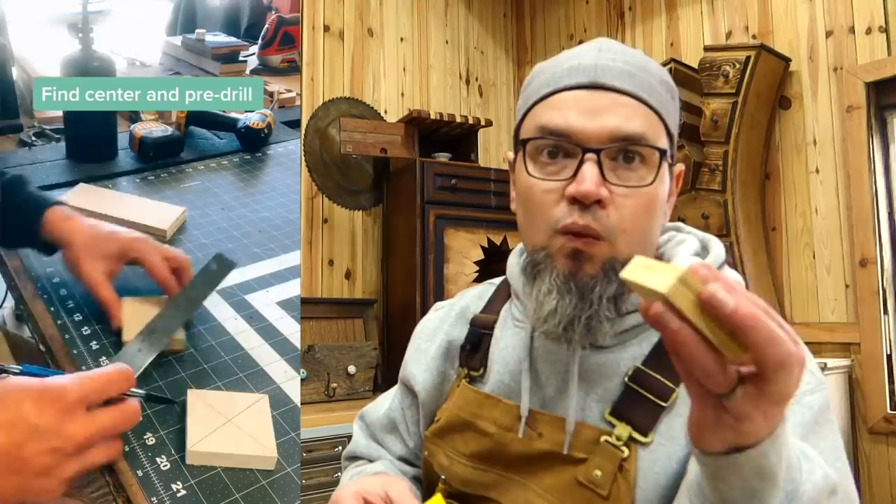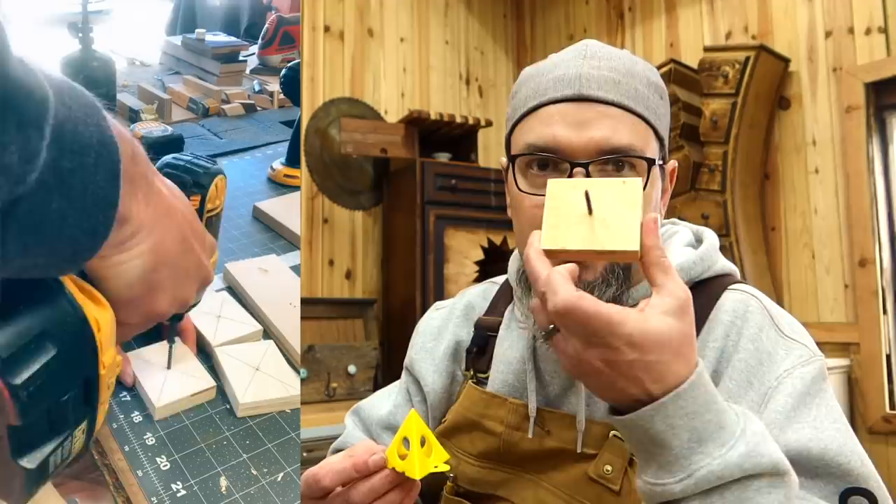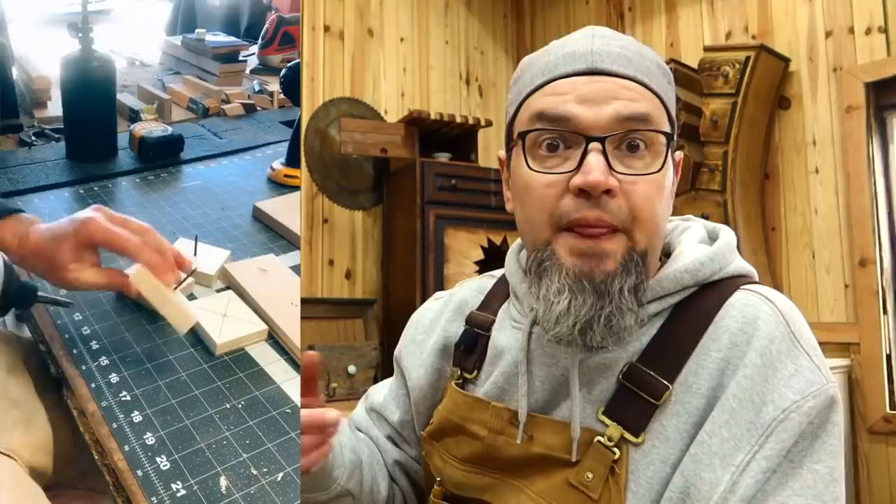I'm basically just taking some scrap wood and making standoffs for painting, staining, or whatever you'd like to do. They do sell these little cheap standoffs, but the ones we're making in this video are heavy duty — they have a lot more balance, they don't tip over nearly as much, and they're made out of scrap wood. Super cheap to make. I keep a box of these laying around so I can work one piece of material and then get back to working the other side without waiting for it to dry. Why buy them when you have everything in your shop to make them for free?